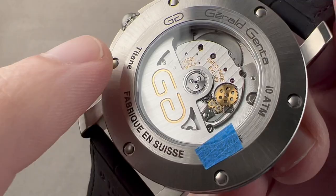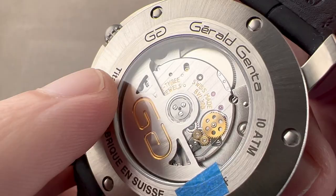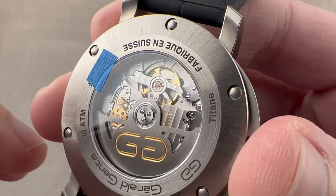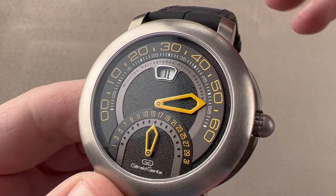We have a couple of different finishes on the reverse side: media-blasted bolts, a radial lapping machine-applied satin grain, and then a concentric circular brushed pattern adjacent to the crystal — Gerald Genta branded throughout. There's a lovely matte finish to the barrel and the screw heads are all polished. We have Côte de Genève, albeit likely mechanically applied or stamped, across the bridges, and a matte-finished base plate. It's a good-looking movement, though all the hardcore artistry is on the movement side under the dial. An absolute knockout, a personal favorite of mine, back in action — and possibly soon to be on my wrist or yours.